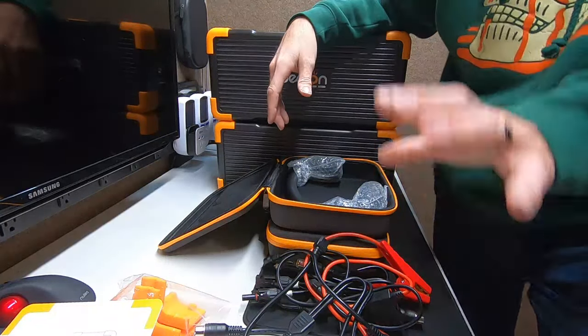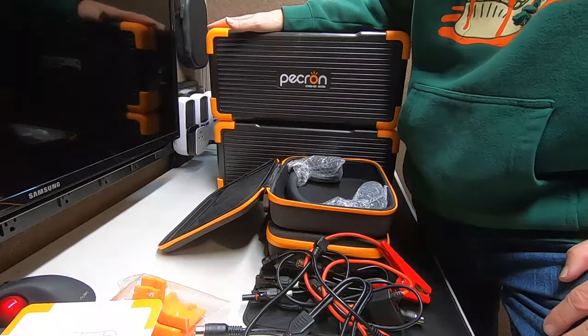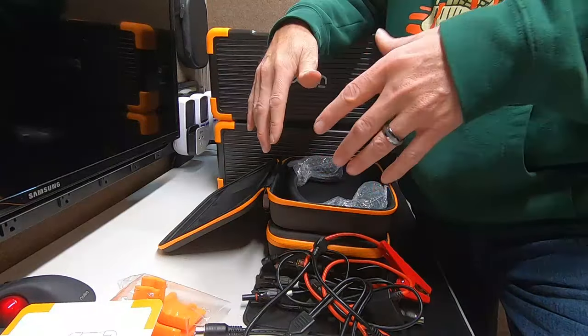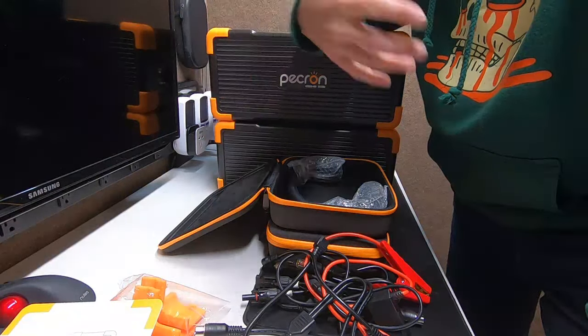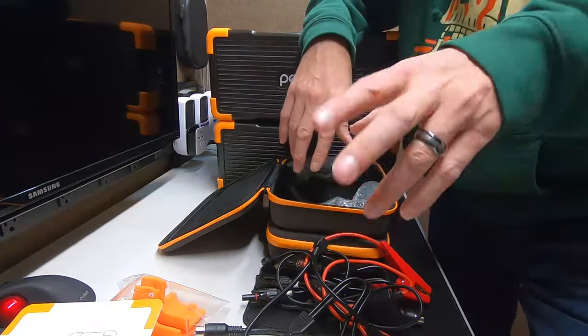So I recommend, guys, anywhere between 12 volts and 80. So if you're going to do two in series, go up to 80. If you're going to get two 45 volt open circuit panels, like we have REC 45s, if you put them both together, that puts it up to 95. And there's two reasons I do that.